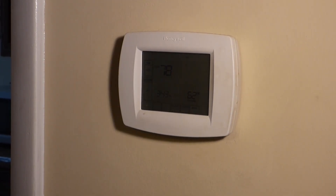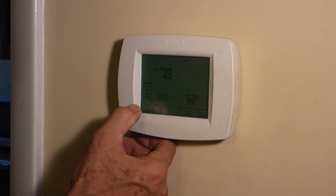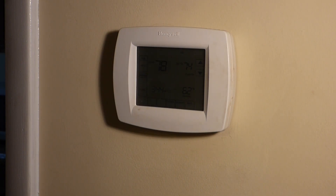Here we are in the bathroom underneath the unit, and it did leak through — not good, but just a little bit. That'll dry up. A little Kilz primer on it, then paint over that and you'll be good to go. But be sure to keep your condensate drain line clean — that's the key. Here we are back at the thermostat. Just a tap here to light it up, and it's on off right now. Turn it to cool — it's flashing, it has to reset itself. We're at 74. I just heard the AC turn on, and this homeowner should be good to go. If this video was a help to you, give it a thumbs up. If you haven't already, please consider subscribing, and I look forward to helping you with other projects online.